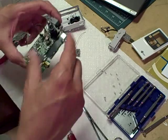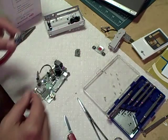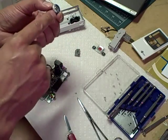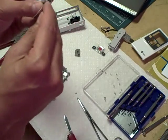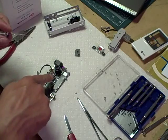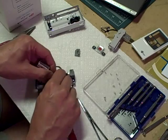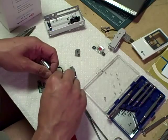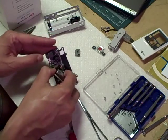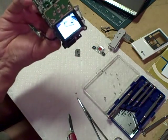Once you have this board taken out, I rigged up something with a 3 volt photo lithium battery instead of the two AA batteries it normally runs with, just because it's a little bit smaller and lighter. One nice thing about these lithium batteries is that there's a little vent hole — I put a little piece of wire through there, twist that on, and that's my positive connection. This is the positive terminal on this board. Then I just twist this cable on here. The camera can then be turned on — the switch is right here on the side. And there it is — it's a working unit.